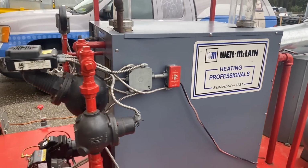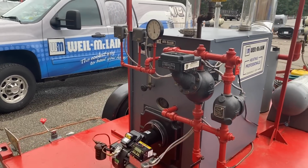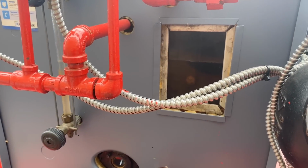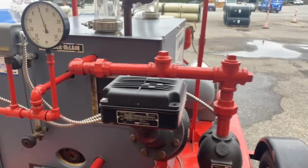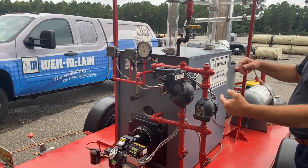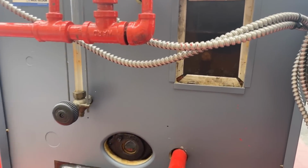So we just shut off our pressure, but if you hadn't heard what I said a couple minutes ago, we probably haven't even made steam yet. We just expanded the water. We warmed up the water, expanded it, and shut off on 5 pounds of pressure. Did you see any boiling going on in there in the window? Very barely. Just a bubble here, a bubble there.